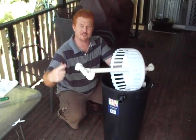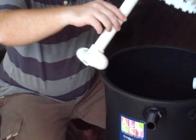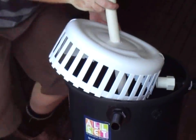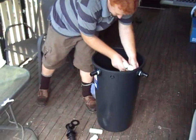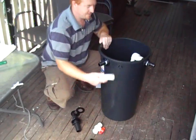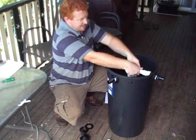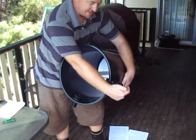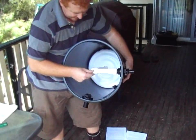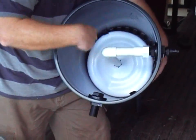I'm trying to make a vortex in the bottom so that the water circulates. It goes in from the pump, down into this pipe, and connects into the elbow. Basically, the water feeds in from the pump, hits the elbow, goes right to the bottom of the bucket, and spins at the bottom so all the muck will stay down there.